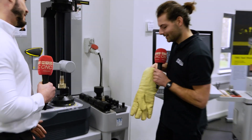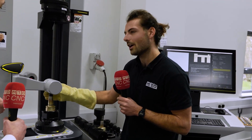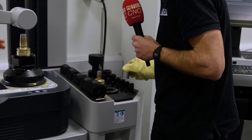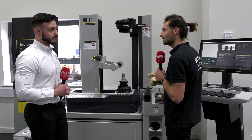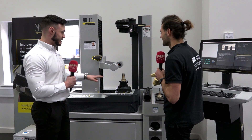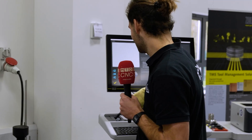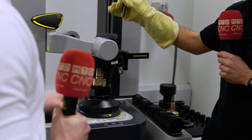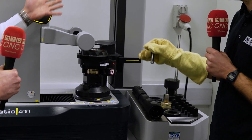It's always: put a safety glove on first. The induction coil here is going to heat the tool holder to around 300 degrees Celsius in just under four seconds. It's not just the heat itself that's important through the process, but the speed of it. Press F1 and it will start the process — the induction coil is going to come down. Just wait until it goes back up. So it's heating the holder up now, and we're extracting fumes as well.